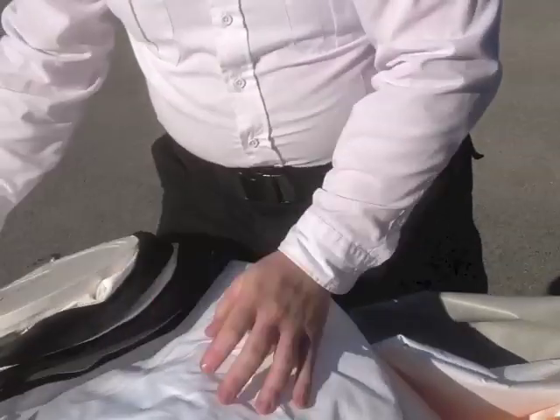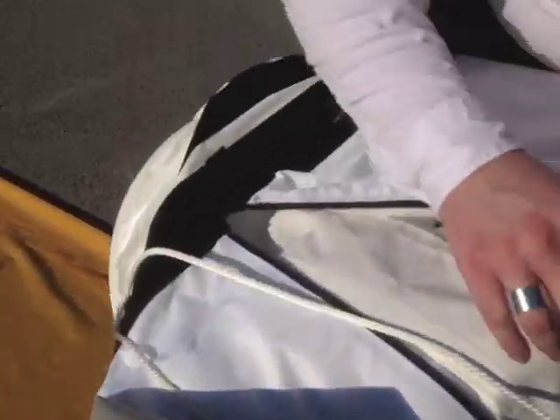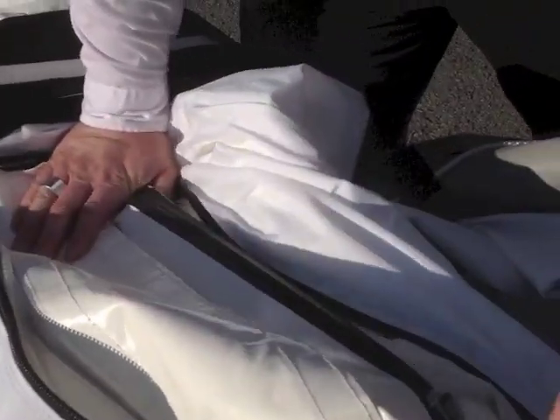John is hooking up the control rope — that's the most critical item when you're deploying this thing. It gives you complete control over the tower while you're deploying. At the top, he is closing the secondary deflation zipper. That's an airtight zipper, underneath the cover.